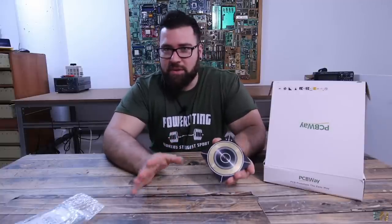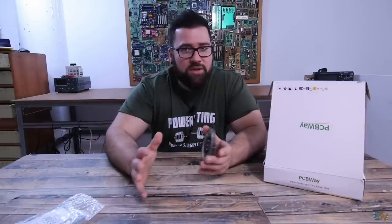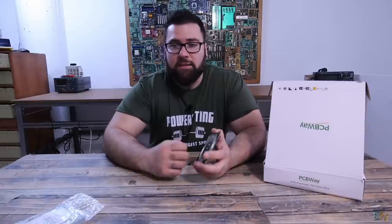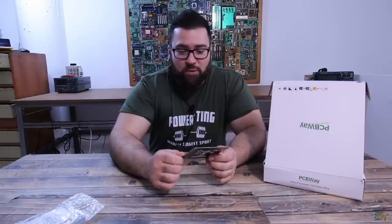I'll share with you the Gerbers for the PCBs for both the top plate and the bottom plate, which is not ready yet, but that will have some 555 timers to create the oscillating signal. We apply that to the coil and the capacitor. That will create a resonance signal with high voltage, and that high voltage will create plasma arcs at the rhythm of the music. It will be quite awesome.